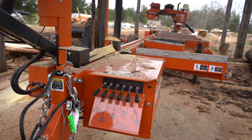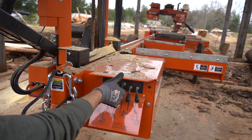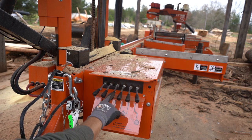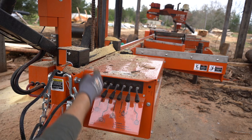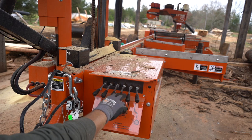Then you have another thing to be cautious of. If you're reaching down here and not looking, and you accidentally raise this lever instead of turning your log or raising your log stops, then you have the problem of cutting the cant on a diagonal. I did that on about my sixth log and learned my lesson. Hopefully it's not repeated.